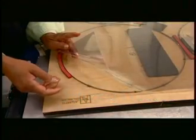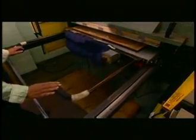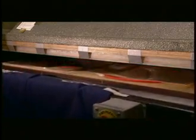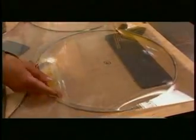Unlike traditional drumheads, today's modern versions are resistant to fluctuations in humidity, making the drumheads more reliable in a variety of conditions. The drumhead begins with the cutting of plastic film into circles. Evans craftsmen load several sheets of the plastic into a die cutter that uses 75 tons of pressure to cut circles that match drumhead sizes.